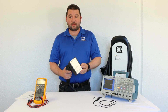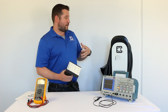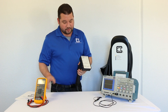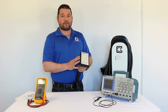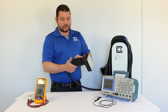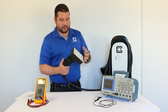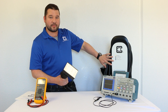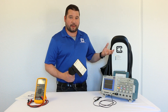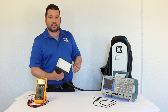Now we're going to do some more advanced troubleshooting. We've tested to make sure the station responds properly to a vehicle's request for charge. If you're still having trouble charging or want to check more information about the station, we can use a digital voltmeter to verify that when a charge is requested, we have the proper voltage available. We can also test the proximity latch circuit. After the CCID trip, I went ahead and reset the station to clear that fault. You can reset the station by cycling power — turning it off and then back on — or you can let the fault clear automatically after about a minute, so long as the fault condition has been removed.